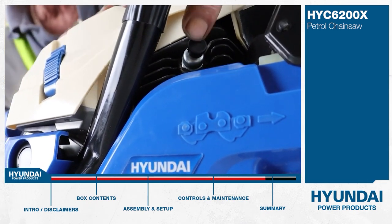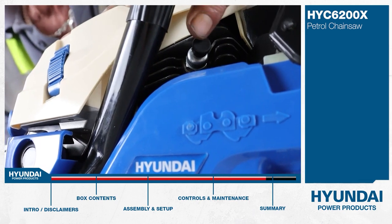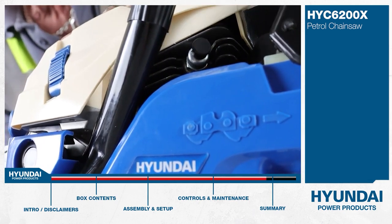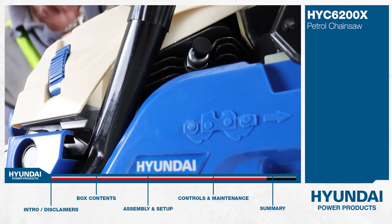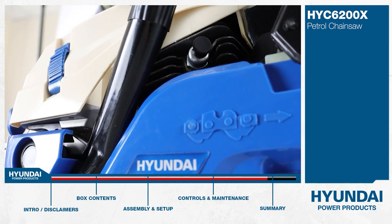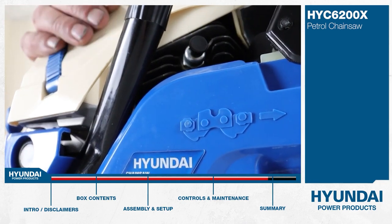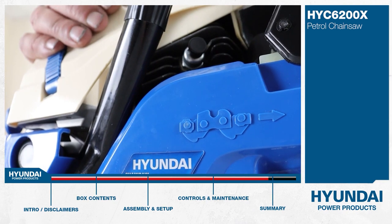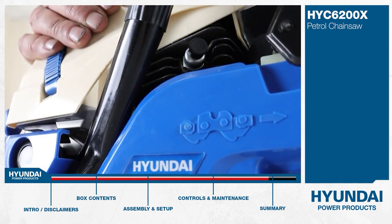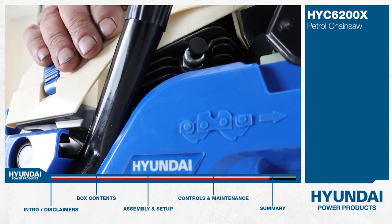Your chainsaw will start readily without using this feature, but I'm going to show it to you anyway. On the side of the engine here, on the head, is this black button. If I push it in, that releases compression from the engine, so that when I pull over with the recoil, during the first turn, it allows me to pull it, gives me more momentum, and the engine will spin over faster and start more readily. We don't need to do anything with it.